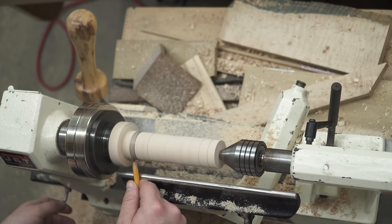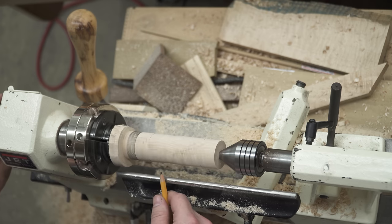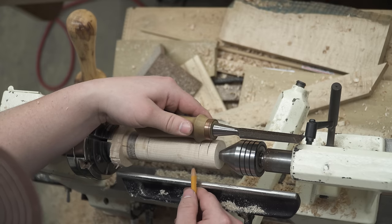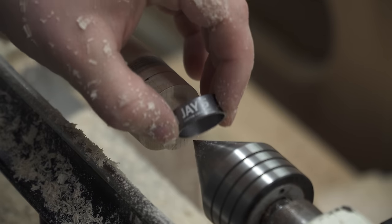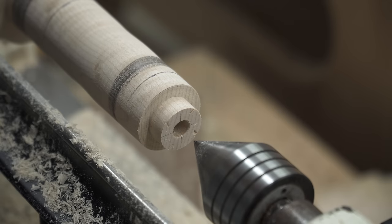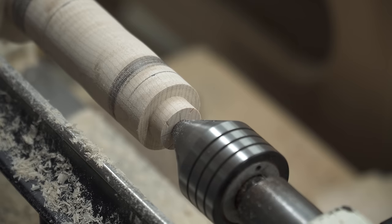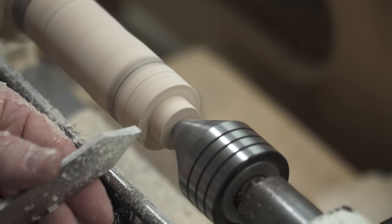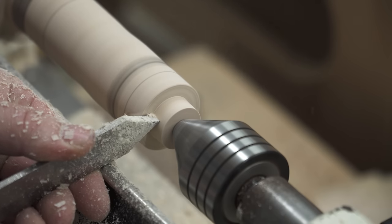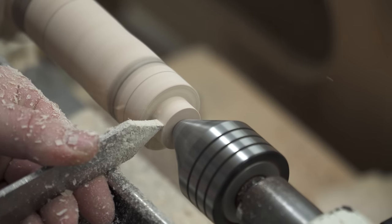I was going off my last handle here, so getting these marks was pretty easy. If you don't have anything to go off of, that's one of the joys of woodturning — you can make anything you can think of. Handle shaping can then begin, and I started with the parting tool to create an appropriately sized tenon for the ring. I snuck up on a perfect fit and it took quite a few tries, but remember that running the lathe in reverse will not put the wood back on if you screw up, so take very shallow passes to really sneak up on the fit.